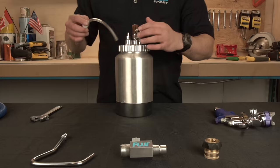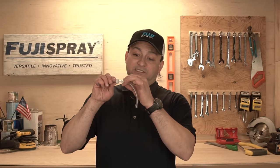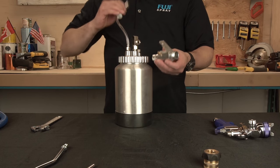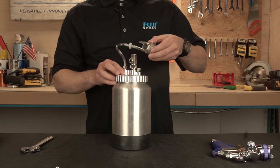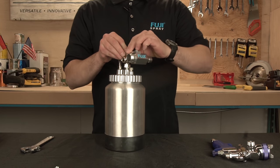We're going to start off by attaching the pressure tube to the pressure pot lid, and you really need to make sure that the tapered side is pointing towards the cup. The other end of the pressure tube is going to be connected at the brass nipple of the air connector. Position the hole of the air connector bracket to align with the fluid coupler and ensure that the air pressure tube does not kink.